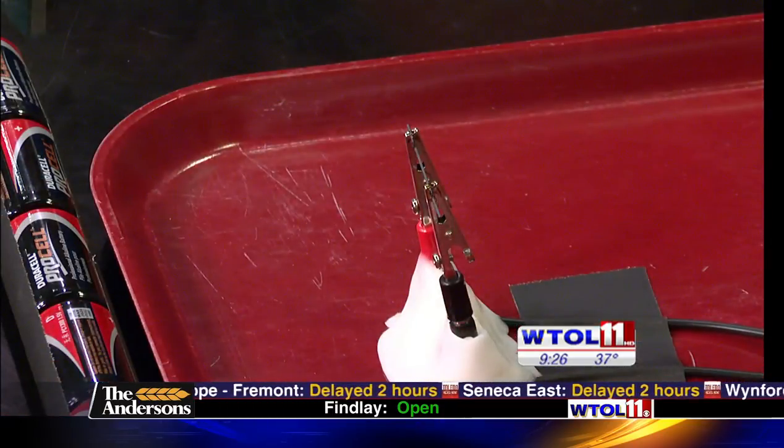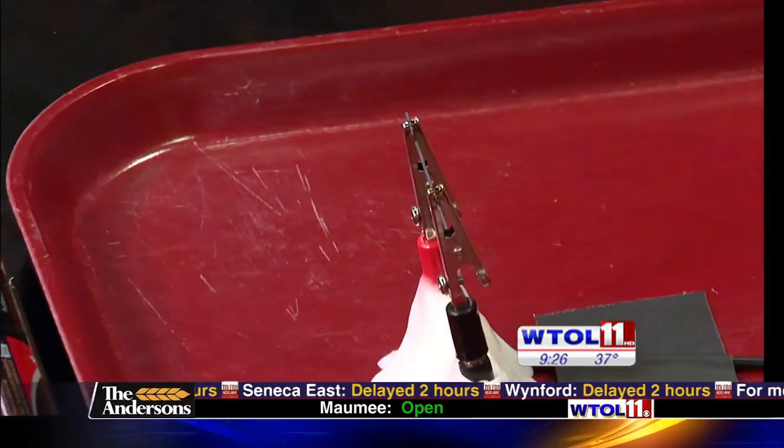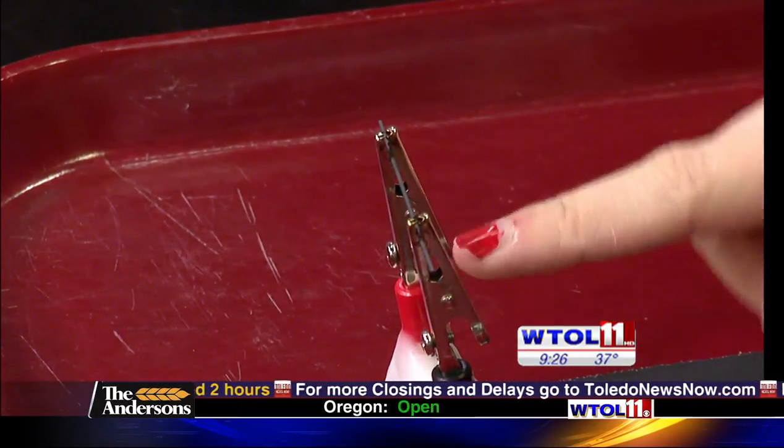Let's build our own now. So instead of using a little coil, we're actually going to use pencil lead for our filament today. I've got some pencil lead here. What's interesting about pencil lead is that it actually doesn't contain any lead — it's actually just graphite and clay. We've got two little alligator clips here with our filament, which is our pencil lead.